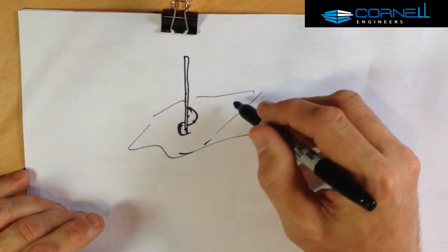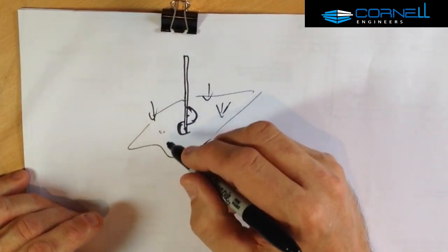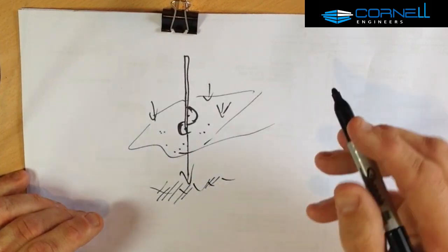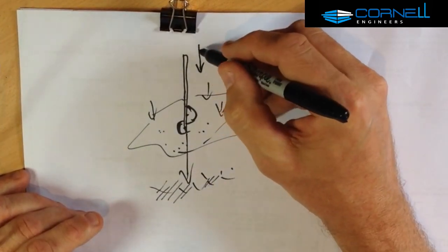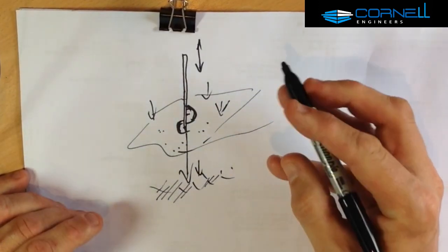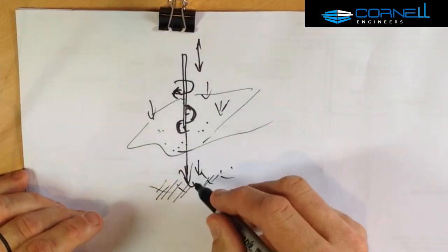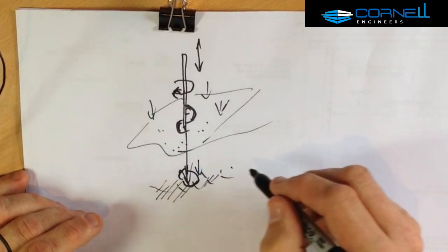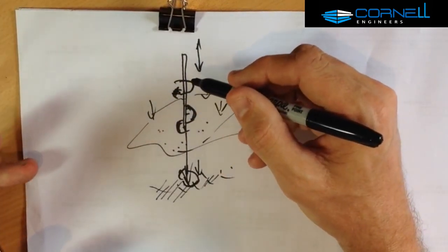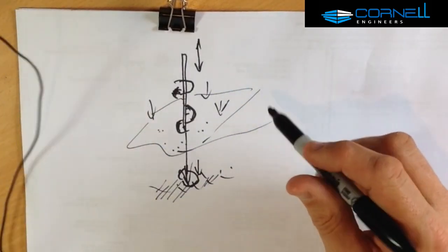The reason we're putting a screw pier into the ground is because the ground surface isn't strong enough — the engineer designing the building is concerned that the surface soil isn't adequate and we need to go down to a certain depth to achieve a good strong foundation. An engineer will specify how much load is on these screw piers, and the screw pier manufacturer has rules about how deep the screw pier has to go — often based on how much torque it takes to screw it down. The stiffer the soil, the harder it is to turn, and when the required torque is reached on the machine, that's when they stop.